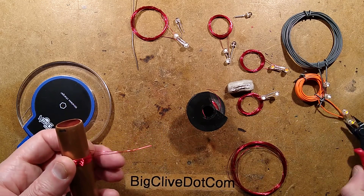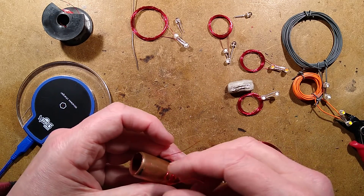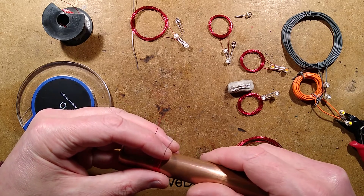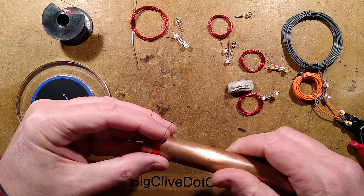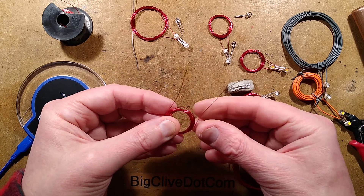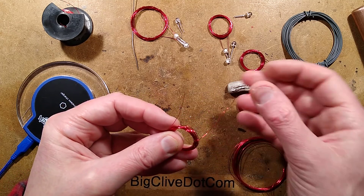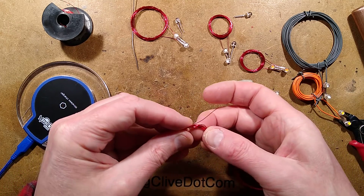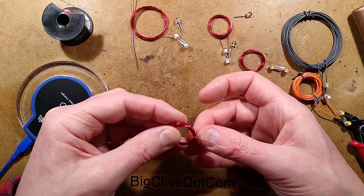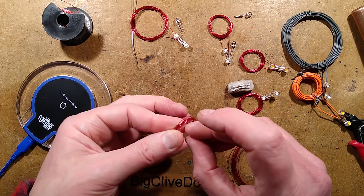So I'm going to cut this off and then carefully slide it off the pipe, noting that it will want to suddenly explode into separate spirals like a slinky. I'm carefully winding it out while holding it together, and then to hold the turns in place I'm using the wire itself to put a couple of loops around. For some reason this is reminding me of a Rogowski coil — a specific type of coil used for single-ended current sensing transformers and some industrial measurement applications.